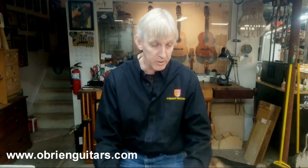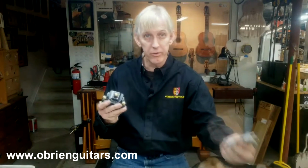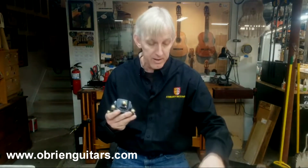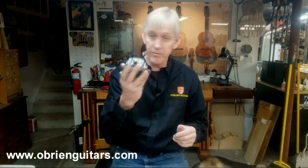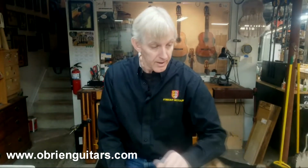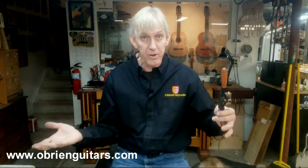I've introduced you to honing guides. I used just the generic kind for years and years and years, and I showed you those little stops on the side of my work surface here to get your correct angle if you want to. These days, and for about the last 10 or 12 years, I've been using the Veritas honing guide. I showed you how to get your bevel on there. I use a 35 degree for the primary bevel.